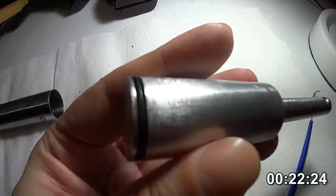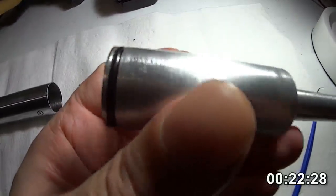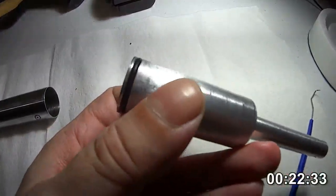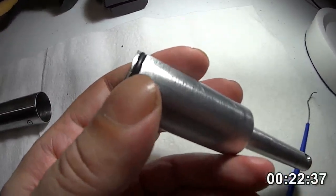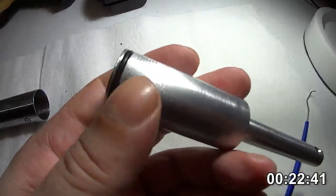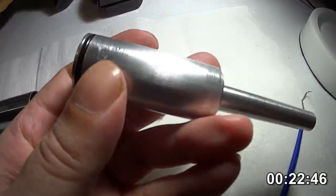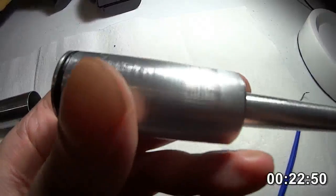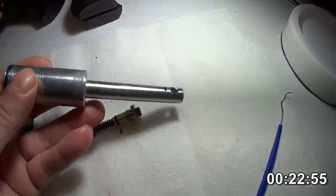But I suppose it's easier just to get the right O-rings, you know, so you have extra O-rings. But this is for people that might be on an extreme budget and don't even have a dollar to spend. They might want to think of this option of rotating this and just pushing it up just a little bit further so it gets past the hole, so that the hole can work on another surface, and then keep doing it and keep doing it, like in a full circle. So it's not always wearing away on one part of the O-ring.